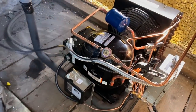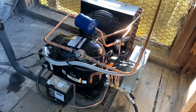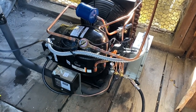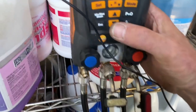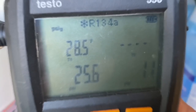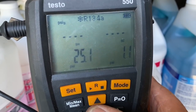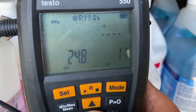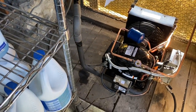I got this thing running. I got the charge to where it's a full charge. The box is probably 48 or 50 degrees right now — they keep going in and out of it. One thing I noticed: because the box is hot, I've got no compressor superheat right now. The TXV is wide open. It hasn't throttled down yet. And I bet if we dig in there and take a good look, that evaporator coil is filthy. No doubt about it.